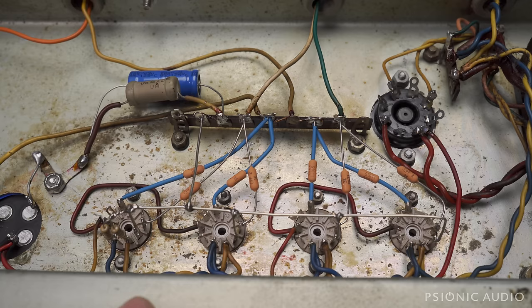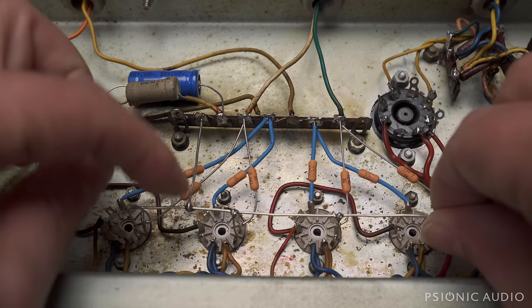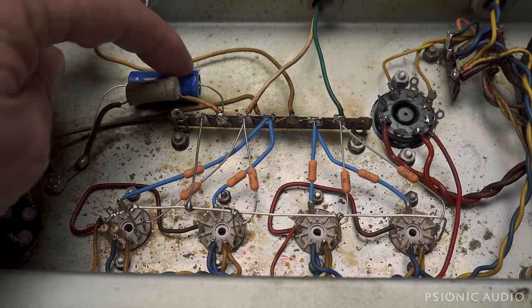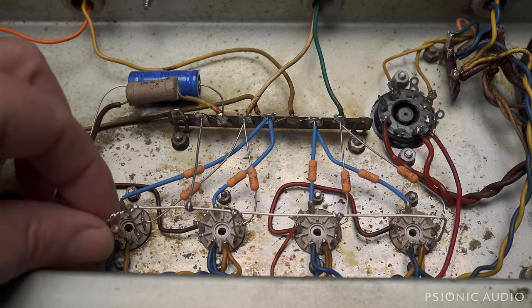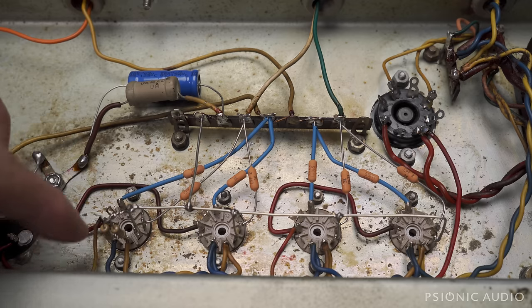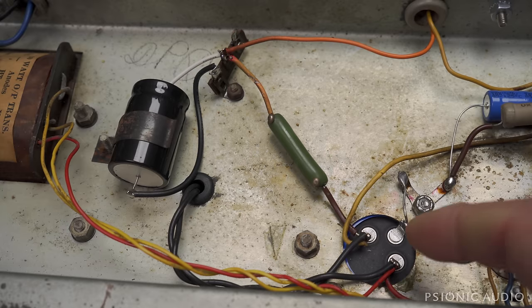And on the other side, you can see the new sockets, the new cathode wire going here, the new cathode bypass cap, new screen grids and grid stoppers, some heater balances, reference to the about 12-volt DC cathode there, and the old ground connection on one side of the heaters in the preamp was lifted. So that problem has gone away. And it's got new filter caps in.